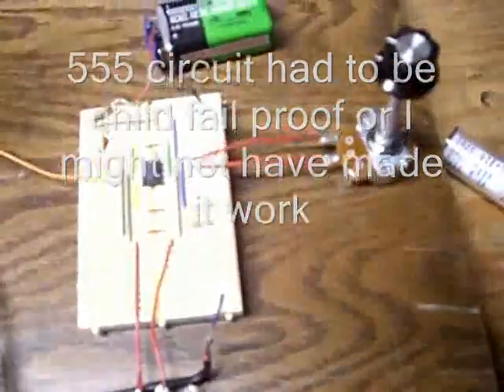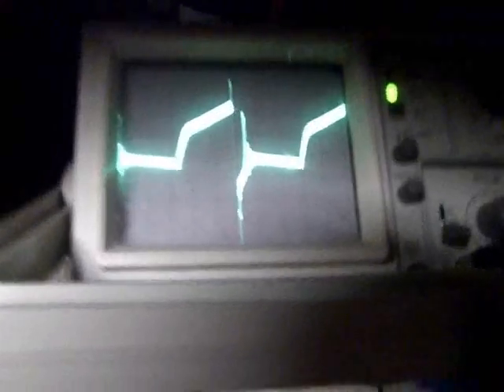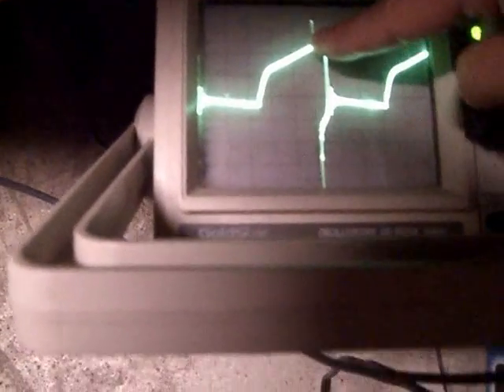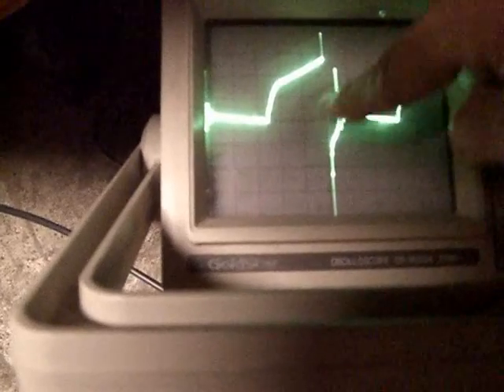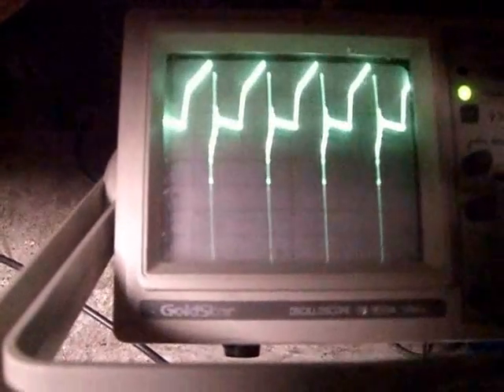My limitation on this is I'm limited to 50% duty cycle or more, and yet I'm able to get this MOSFET into full oscillation. What I'm going to show is basically what's going across the inductive resistor. You can see that when the MOSFET switches on, power goes through the resistor, and when it shuts off it spikes — you can see a spike there — it rings and then it goes back up. You can definitely see that the spikes are being made.